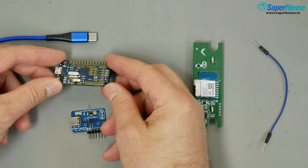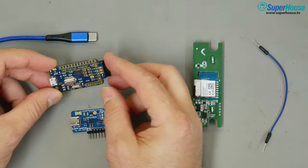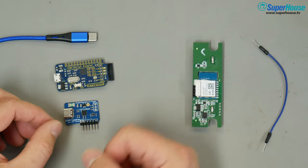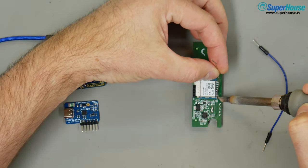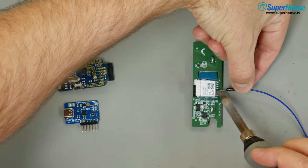To make those connections you can either use a general USB to serial converter — as long as it's 3.3 volts, it has to be a 3.3 volt device — or a specialised device like an ESP flasher specifically designed for flashing these boards. First put a little bit of solder on the pads for GPIO0 and ground, and then use a jumper wire to loop around between them.